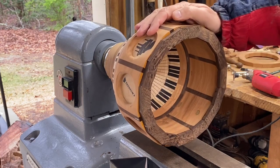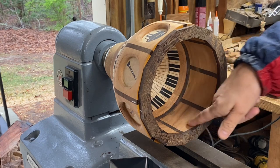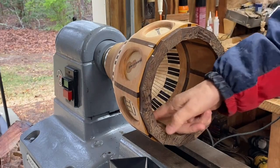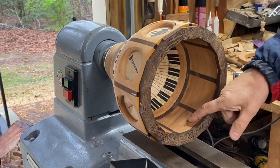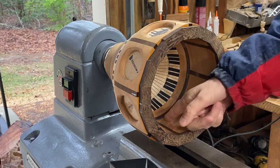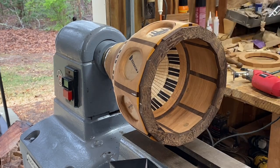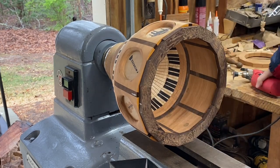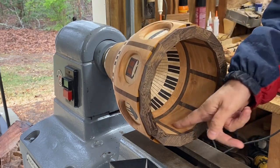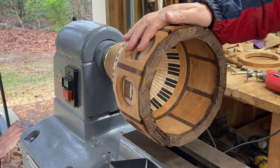I wanted to show you something before I move on. As I was turning on the inside, this is not a knot in the wood — I've got three places where a little bit of the MDF middle panel actually showed through, so I can't turn anymore in here. I'm resorting to sanding. But if I have to do this again, I'm going to go with at least a half-inch inner layer so that I can continue to turn. It was turning just fine; the outside was catching only because the chisel was catching on the window of the porthole.